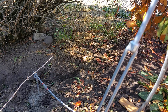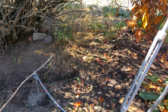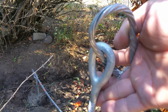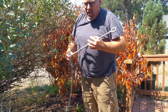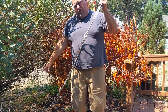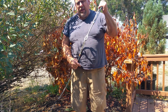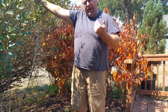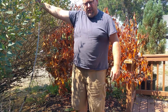Off camera I screwed up and forgot to put the turnbuckle on, so that's now been put on. That was a whoops on my part. One of the lessons I learned: you want to make up the end that goes down to your thimble eye bolt first, because this ended up being too long trying to make it up from the pole — especially since I'm going to pull the pole back. So make up the bottom end first, get your turnbuckle on there, then cut the top down to length after you've got it pulled back. This will be it for right now until we get to tensioning this thing. Talk to you guys later.